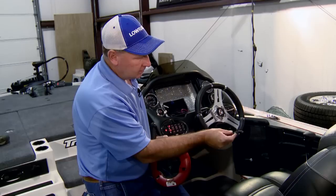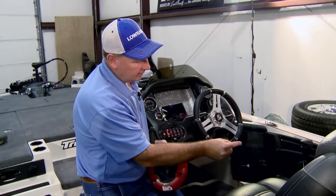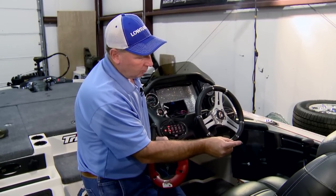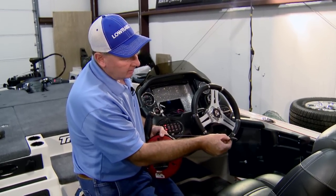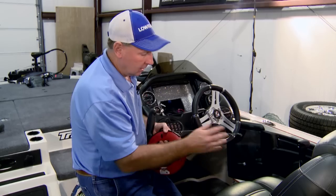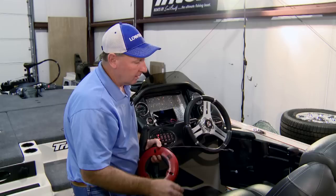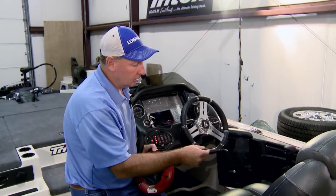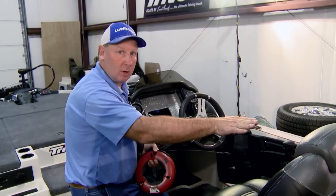One key is, if you see here, some of your fish tapes will have a loop in them on the end. You want to make sure and tape that loop shut so you don't push this through and then, as you're pulling back, have an existing wire go into that loop, because this entire fish tape will be stuck somewhere in no man's land on part of the wiring of your boat, which you have no idea which wire it's hooked to. So make sure you don't have any type of an open loop before you start the fish tape.